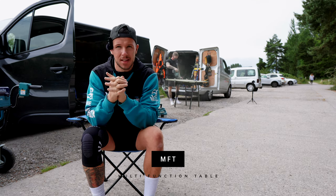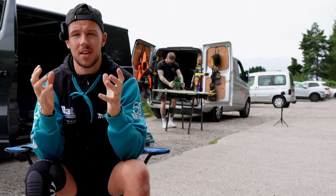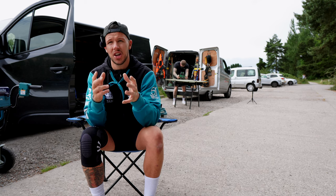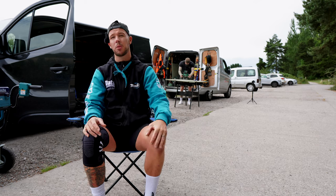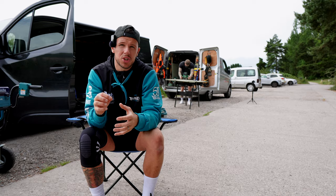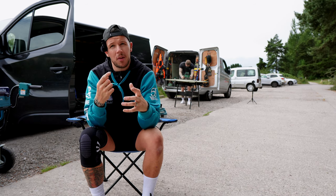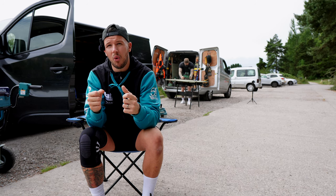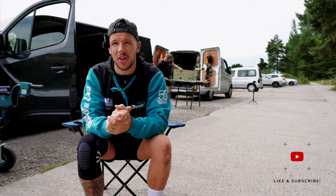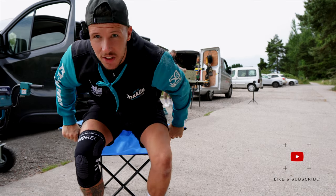MFT stands for multifunctional table. You already know that — it's the reason why you're watching this video. The possibilities of an MFT are endless; it increases your workflow and maintains the accuracy you need both on and off-site. I'll be putting the link in the description below — this will be the bush guide, the self-adhesive foil tape, and the 12mm cutter. It's important you get the foil self-adhesive tape to wrap around the bush guide to ensure a tight hole for your bench dog. If you found this video helpful, be sure to like and subscribe. Both myself and David appreciate it — now let's get back to cutting the holes.